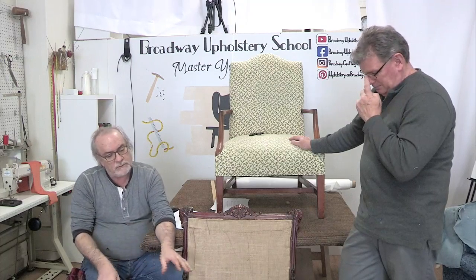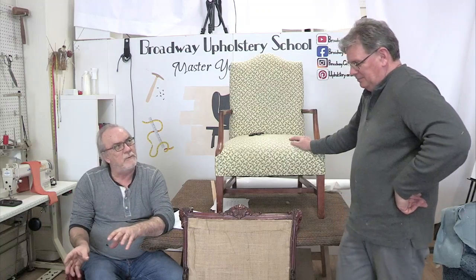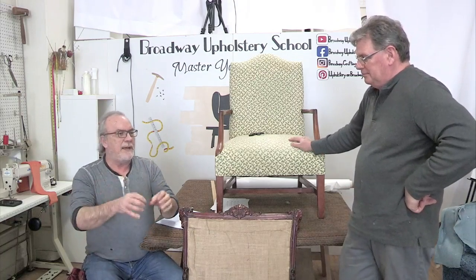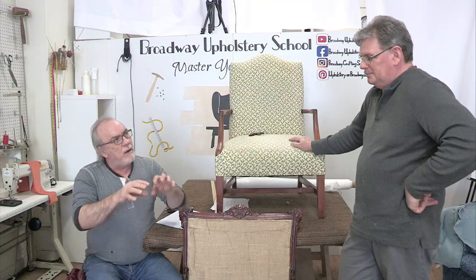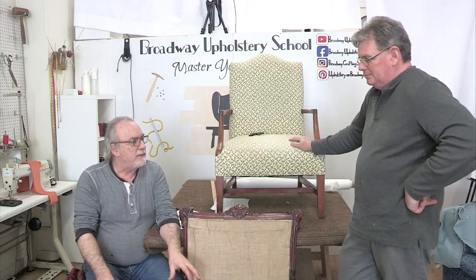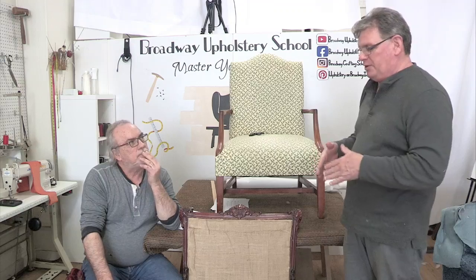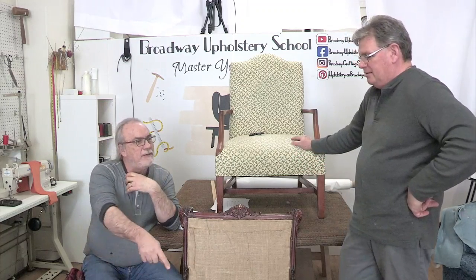What Jimmy's creating in the seat is called a 'cake' - that's what us upholsterers call it. The Europeans are good at building their cake off the piece, but I think that's harder - you have to be more exact and you can make a mistake. When it's attached, they're only attaching it with the burlap and six-ounce tacks. The way we do it is layer by layer on the chair, putting big tacks in the edge roll and making sure it's sturdy and safe with the stitching. I think our method is better, but they might disagree.